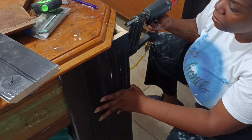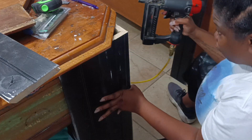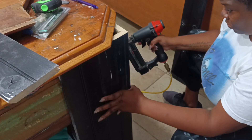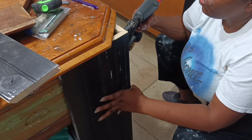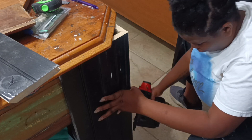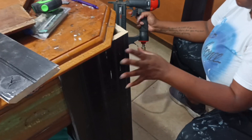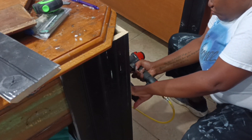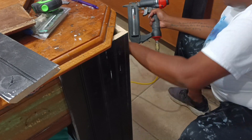I did manage to get some good 45-degree angles, which surprised me a lot, and now I'm using one-inch brad nails to secure the panels on top of the island. The previous shape was kind of diagonal on the corners and I never liked that, so I'm going to use this opportunity to square everything off — I think this small change will help update the look as well. This would have been so much easier if I had somebody to hold this for me while I nail it, but you can absolutely do this by yourself. I tend to prefer DIYing by myself because other people's inputs can sometimes make me feel discouraged, so I just zone out and DIY by myself and I find that I always get things done in a way that is pleasing for me.